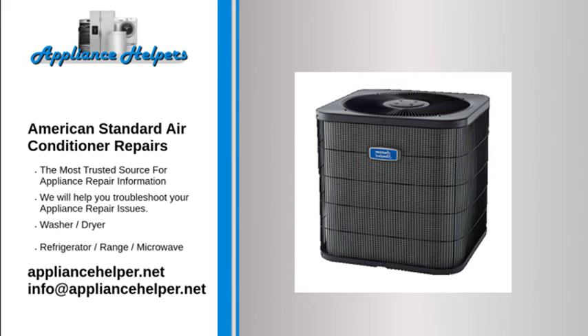Too dry or too much moisture in the air. Check to make sure your humidifier is switched on. Many times, homeowners turn off the humidifier at the end of the previous heating season and forget to turn it back on when needed. Make sure your humidifier's damper or water valve is open. Check your humidifier setting and adjust the indoor relative humidity settings to bring greater comfort to your home.